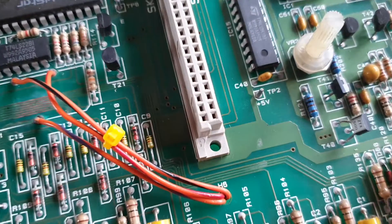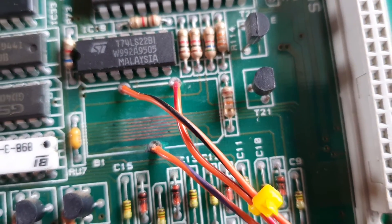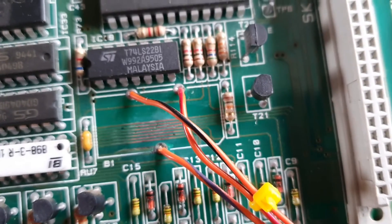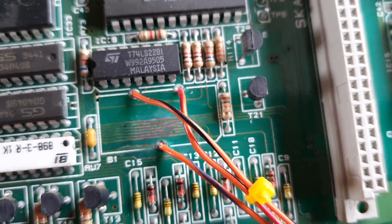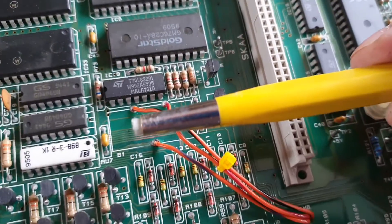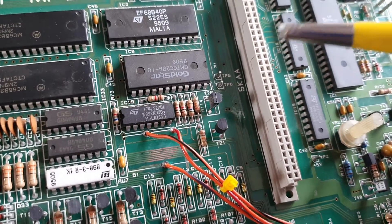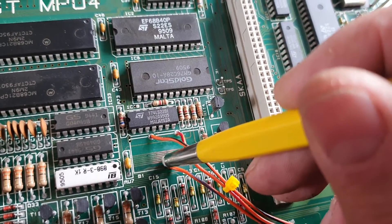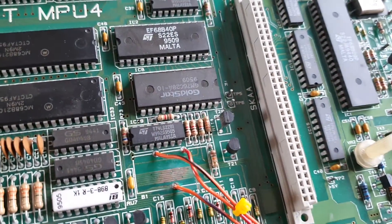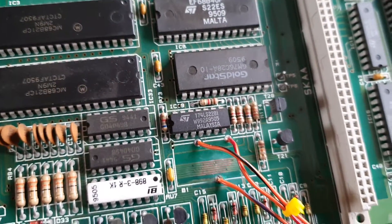As you can see I've fly-wired this one. You can see where it has in the past had a bit of corrosion and it's been cleaned. You do that with one of these — that's a fiberglass pencil. You can use fine sandpaper depending on what you prefer, but these are cleaner. You literally just go over the area and scrape away all of the corrosion from the top of them — that's pretty much it.